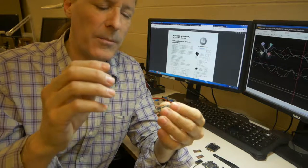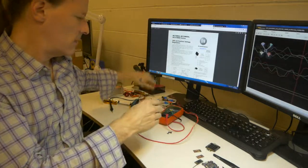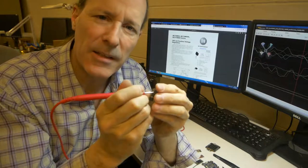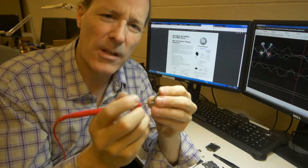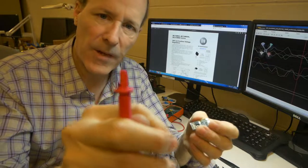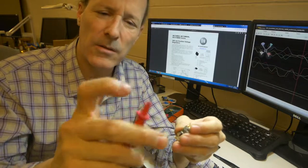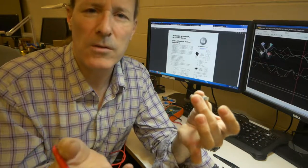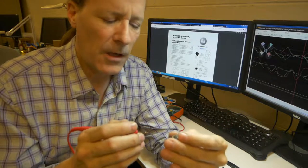But that doesn't mean anything necessarily, because the thing is conformal coated and it's kind of a pain in the ass to take your little probe stick and, on every tiny pad and every little leg of each of these chips, scratch away the conformal coating and hope that maybe you hear a little beep. Also, the big fatty probe tips don't really get down in between things so well. I need to take them out to the shop and sharpen up a set so I can get down in there. Anyways, there are multiple reasons why I know it's here somewhere, I just can't find it.